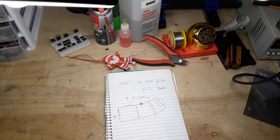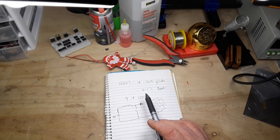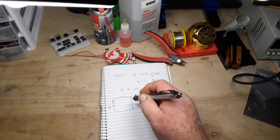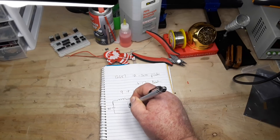The next question is what are we going to use for a switch, because we probably need this thing running at 200 to 400 kilohertz. You could do it with a 555 timer — and I love 555 timers — but there's a catch: the voltage output is going to be dependent on the mark and space of the 555 timer, basically the PWM output. If the load changes, the PWM is going to change, so we can't have that. Our switch is going to be a MOSFET.